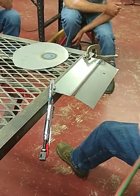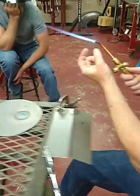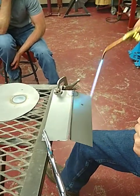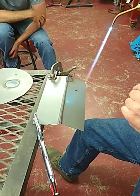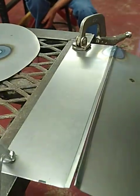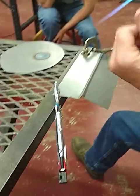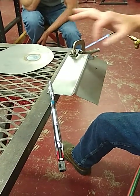You'll notice there's no waving motion — no figure eight, no jag or whatever you want to call it. My tip, the flame itself, is wider than the joint. So if you're fairly accurate, you just have to go straight in, do the joint, and come back out. When tacking, you want all the heat into where you're placing it, so it's pretty near perpendicular, favoring both sides at once. When you go to weld, you want to give it some lead angle and preheat ahead of you. Ultimately, what you're looking for is the heat-affected zone to be equal to both panels.